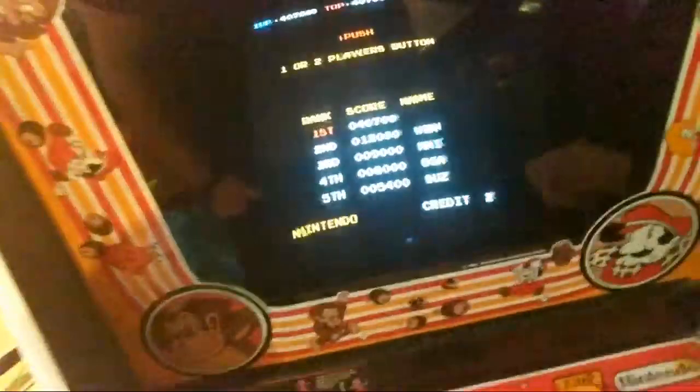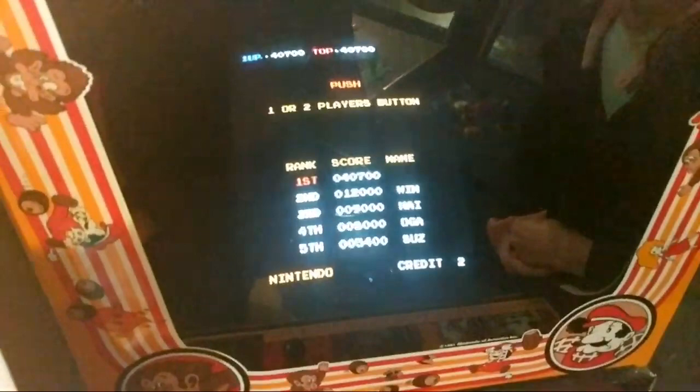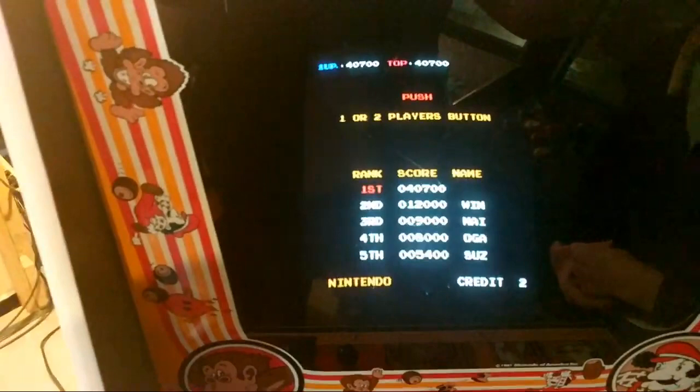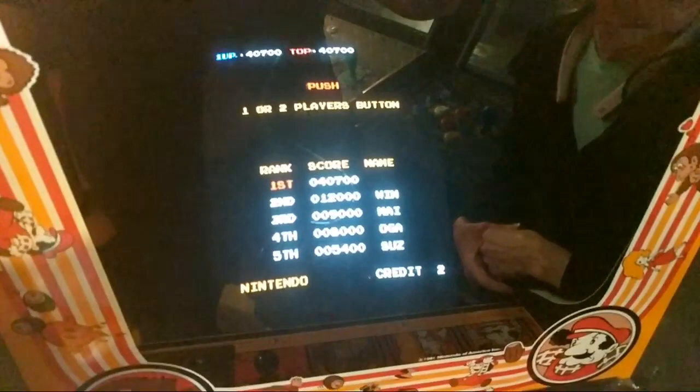No. Actually, you know, Adam, I think it was because John had mentioned it. Someone else did as well. And I went to measure the resistance on the pots, and they were reading zero or infinite. Infinite resistance is what you say, right? And so then I just went to desolder them and they fell apart. So that was good to figure out.